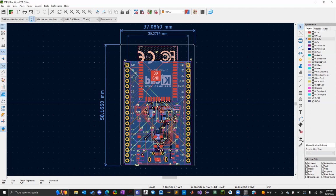And I actually did that recently in my senior design. My project had 140 vias because this one chip on the bottom left corner had four traces that had to go all the way across to a connector on the other side of the board. You can actually see that on my old design. I'll show you guys later. So I took that chip and I moved it next to the connector. I took the components there and moved it back to the bottom left. And it literally cut the amount of vias on my board in half. And what that means is I have to go from the front to the back layer less often. And generally, that's a good indicator of a better layout.